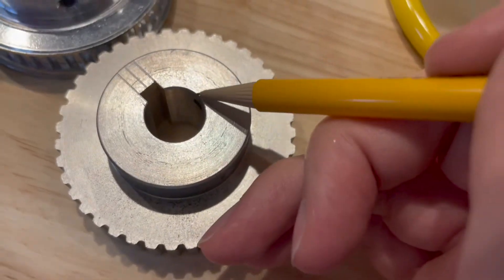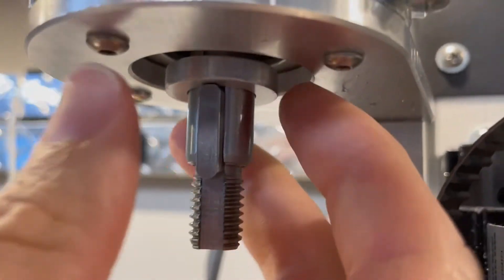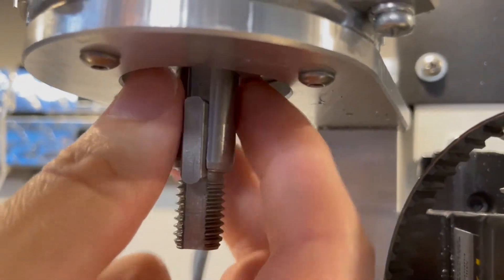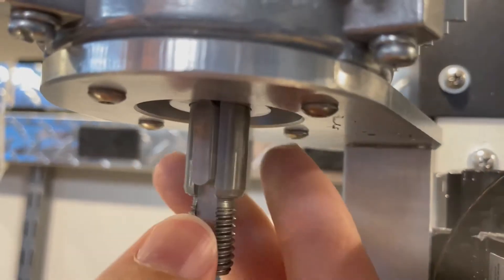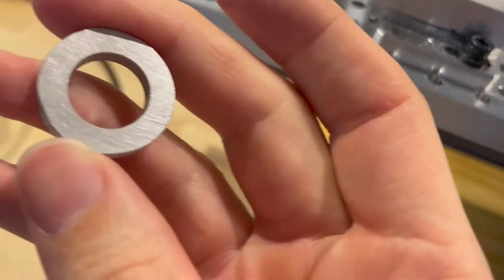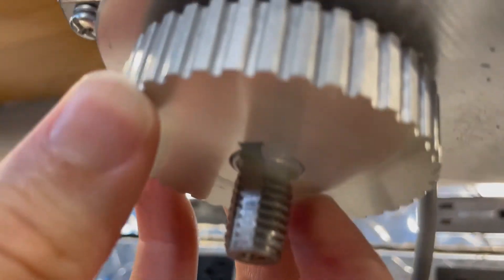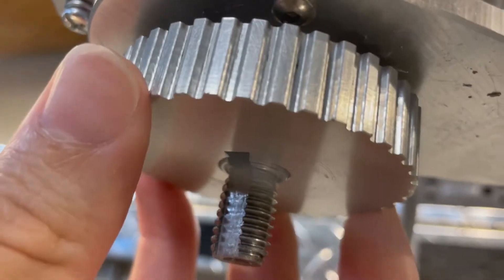On the BBman pulley, you have to bore this out to fit on the motor. I also made this spacer here. With that spacer, it leaves just enough room for the shoulder to be a little bit inset. The spacer goes against the inner bearing race. Without the spacer, the shoulder's proud, so the nut won't compress on the pulley.